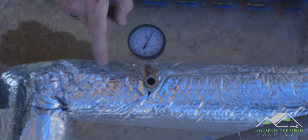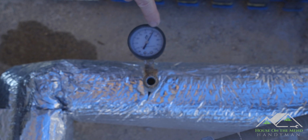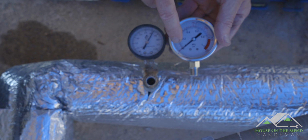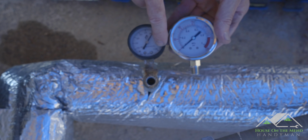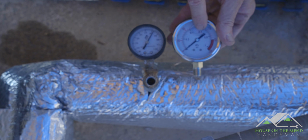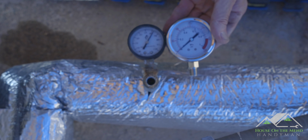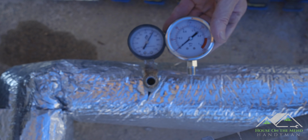We've completely drained the system, and it's still registering at 65 pounds of PSI, so that's when you know these are broken. And that's the nice thing about this pressure switch here. Number one, it's rated for higher pressure settings. This one only goes up to 100. But number two, you see this little bubble in here? This is liquid filled, and it's filled full of like a glycerin base, very similar to, say, ethylene glycol, which is antifreeze.